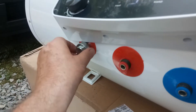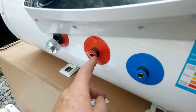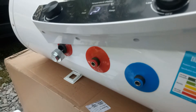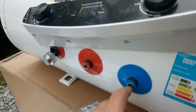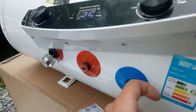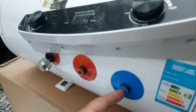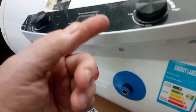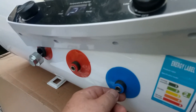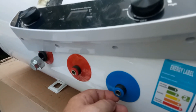Here's the hot water outlet — notice this little metal tube. That metal tube goes up to the top because that's where the hot water will be. On the cold side there's also a metal tube, and what it probably does is swing off at an angle toward the heater so the cold water doesn't shoot straight up to the top and mix down the temperature.